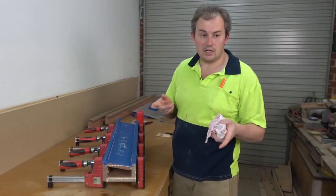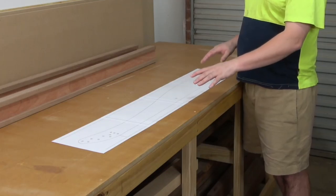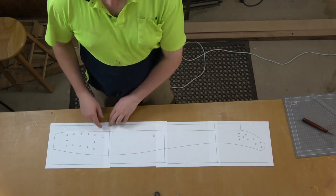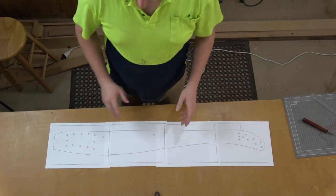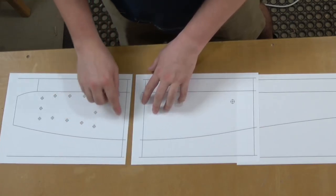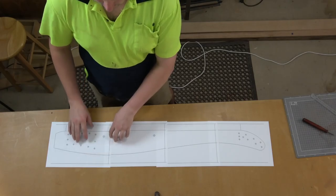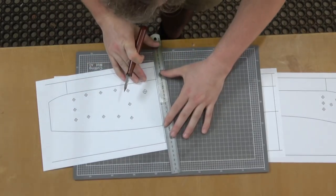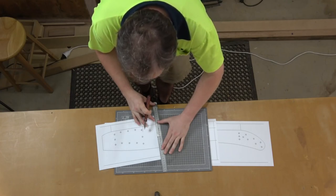I'll put this away and we'll start making a template for the legs. Here I have the paper templates I'm going to use to create the leg template out of MDF. I need to join these together because they're just individual sheets of paper. I've got horizontal lines going through them, which gives me a good location to join them together. The line weight is about one millimeter wide, so I can't just join line to line willy-nilly — I need to get the line directly over the top of each other. So I get a cutting mat and a ruler, and I cut straight on the inside edge of the line.